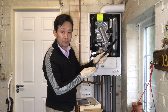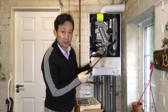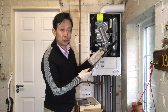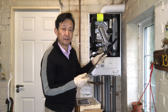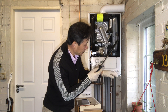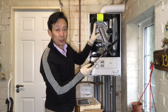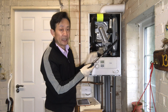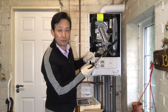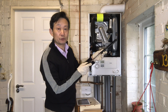What I will do now is remove this pump and switch on the central heating boiler. I will check if the pressure can be maintained or not. If the pressure can maintain over a few days, this should be okay temporarily — to keep your central heating system working until you can find an engineer to come and replace the expansion tank. However, if the pressure keeps dropping again, which means the leak inside is too severe, you will not have room for your air and you will need to replace the tank as soon as possible. If you are lucky, the leak is in the lower part of the expansion tank, and by doing this you may be able to use it for quite a long time before replacing.